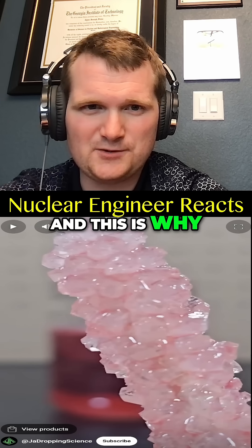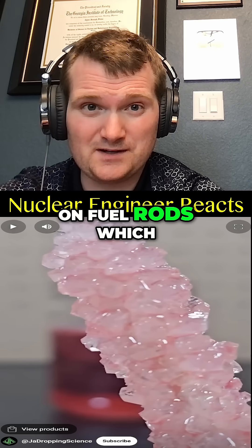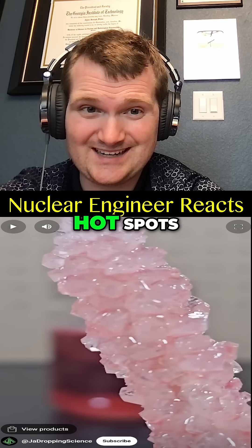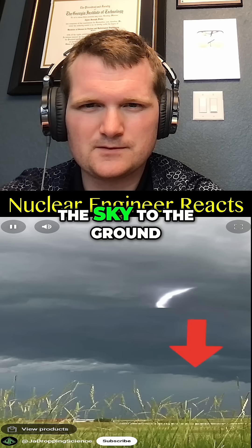After leaving the chopstick for a few days, sugar crystals have grown on it and you've successfully made rock candy. This is why you keep your reactor coolant loops as clean as possible, because impurities can build up like that on fuel rods, which can alter thermal conductivity and even cause localized hot spots — you really don't want that.